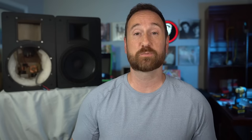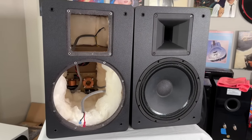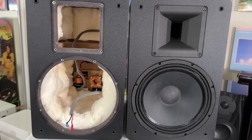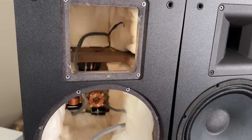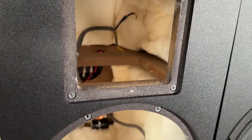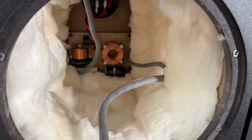I'm going to show you a video of the speakers inside and outside while I walk you through some of the manufacturer's specs. These are a two-way loudspeaker with an Ohio-built and finished cabinet. They feature a one-inch polyamide compression tweeter, a cast aluminum exponential horn, and a 10-inch high-efficiency neodymium woofer. Spec sensitivity is 95 dB at one watt, one meter, but my measurement shows something lower than that — we'll talk about that. Nominal impedance is 8 ohm. The speaker is also sealed, so it is not ported.